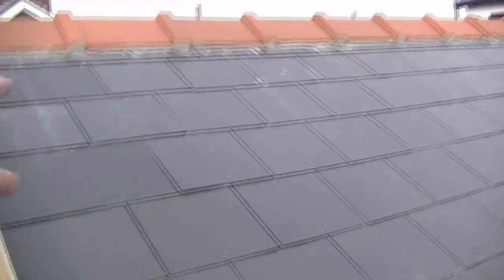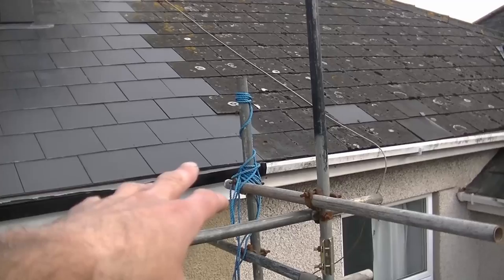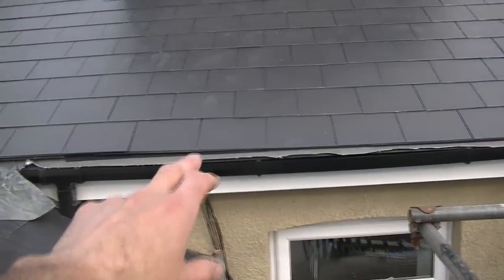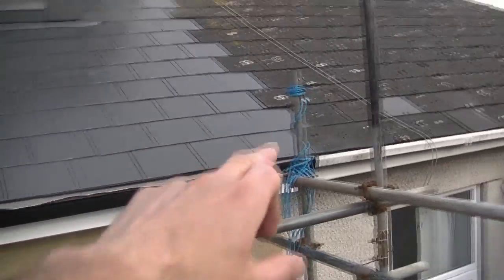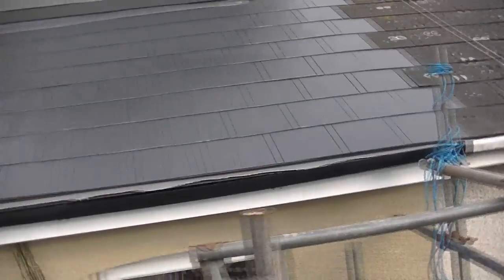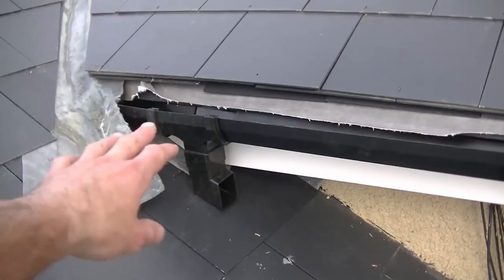Coming round here, exactly the same. We've done our gutter now on this side, connected up with next door. I had to use my joints here because I'm using Brett Martin guttering, which is what the building merchants supplied me with. Now they are not compatible with Flowplast, but they're slightly bigger, so if you use the Brett Martin guttering joint you can sit the Flowplast inside it. If you do it the other way you won't actually get the Brett Martin gutter into a Flowplast clip - it'll just sit up slightly, so there's always a risk of it leaking. But that seems to have worked okay because we've had a lot of rain and there wasn't one leak. Again, I've just done a little shoe there to run out - a lot of people just drop those straight out which I'm sure is fine, but I just didn't want it going straight down on the slate, so I fire it out towards the gutter. We've put this gutter in here, finished this off this morning. I've got my downpipe there and that goes down there into the drain.